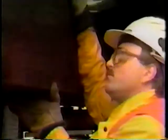The most critical phase of the operation occurs after the old cap is out and before the new cap is secured in place. Speed is essential at this time. Boom up, line down. Essentially, getting the new cap into place is a reverse of the removal procedure. The new cap is hoisted to the rollers and pushed onto the rollers, then into place.